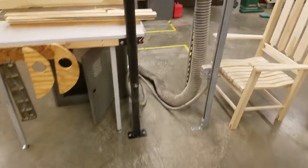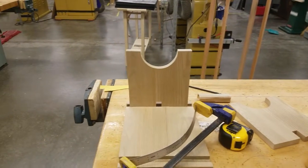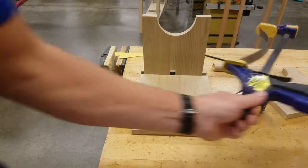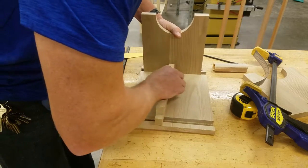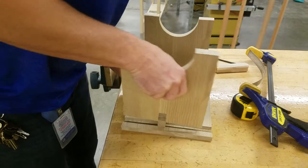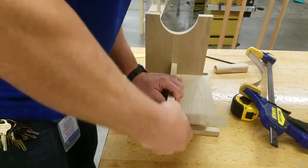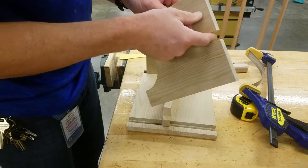Then you take it over to your footstool and you check for proper fit. So you'll put this here. Get you squared away so you can see. This should fit inside of here. Get the other side. That goes in there like so. This goes in here like so. I need to do a little bit of filing. So it looks like on this one leg, I'll have to file a little bit outside of this.